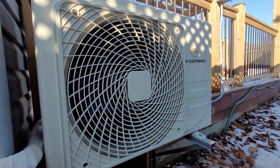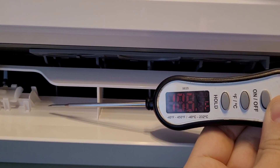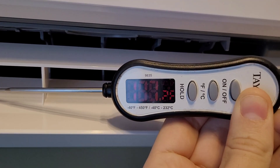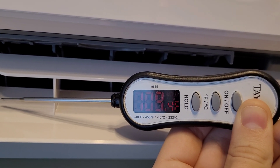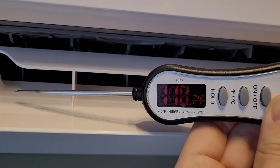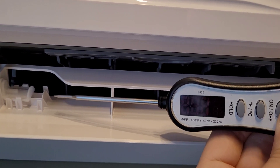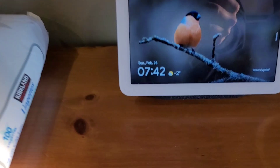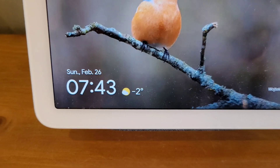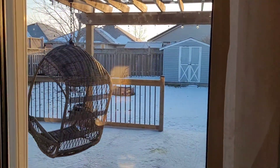The unit is up and running now — it's very quiet. I'm going to take you inside and show you some temperature readings. Right now the high-wall unit is kicking out around 110°F of indoor air, which is pretty good. The house is around 70°F, so that's a pretty good temperature rise for a cooler day. We are sitting around minus 2°C right now. Pretty good for a unit that claims poor performance below 7°C — it's doing well at negative temperatures.